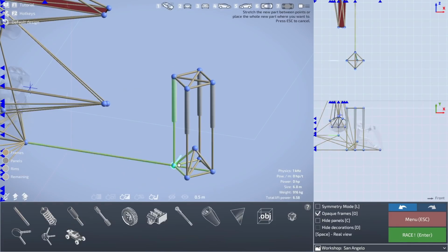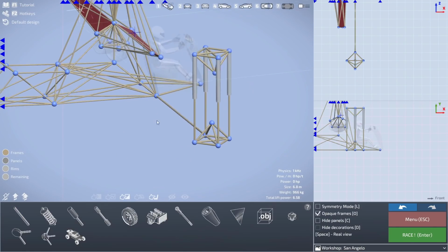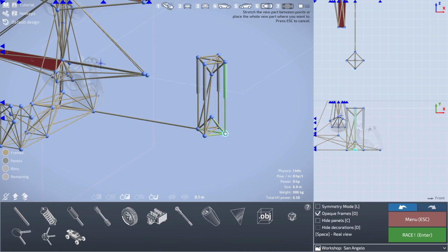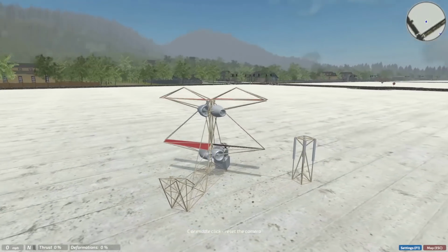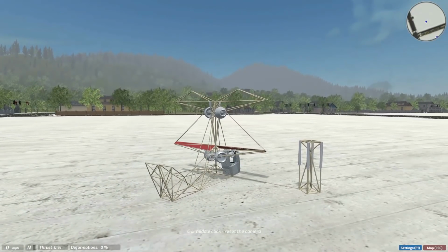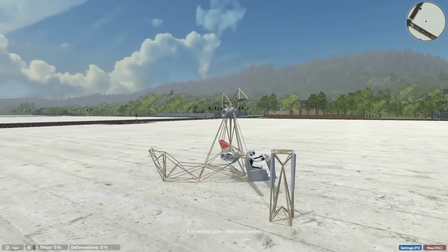So what I did is add in 2 of these pyramids to the top and bottom of the Swashplate, and then connected them together with a few framing pieces. And this should prevent the plate from moving up and down at all, but it should still be allowed to freely rotate around that connection point, which is fine because I'll add in the up and down mechanism separately. As long as I got the tilting working with this, I was pretty much happy.